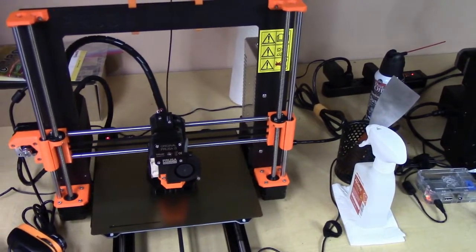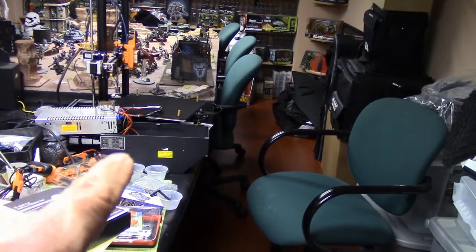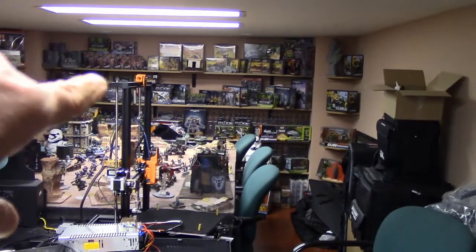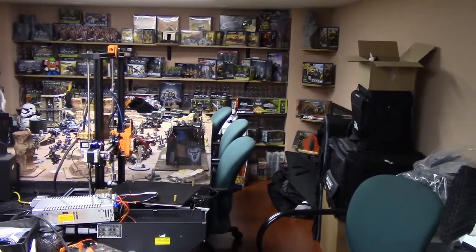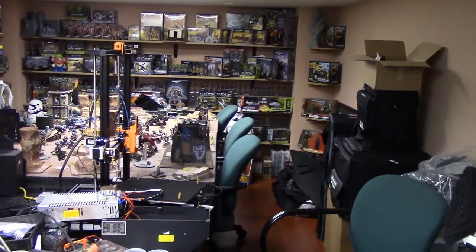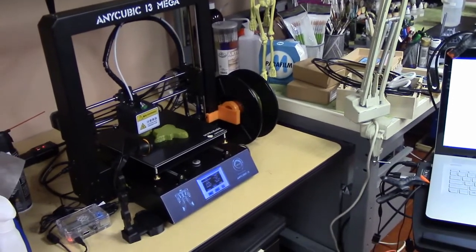And even all the parts on, excuse the movement again, that's a PETG fan duct for the fan on there, and also there's a new fan mount in the control box, all ABS. And even on there, there are what are called badge hangers that hold onto the PTFE tubing and the cabling going from the hot end and the thermistor and all that, to keep it up and keep a consistent angle on the filament going into the hot end while you're printing. So that's why I love using ABS for parts like that. It's very durable and it's a lot more heat resistant than PLA. But I've used PLA too.